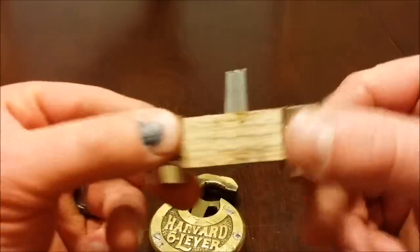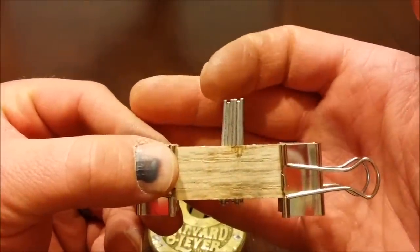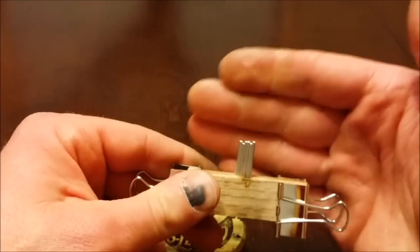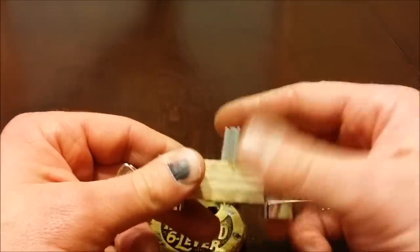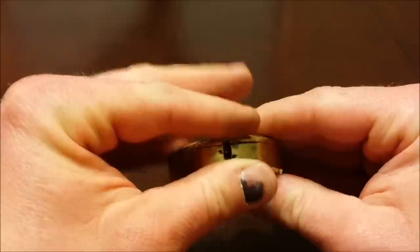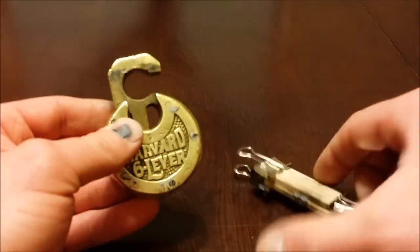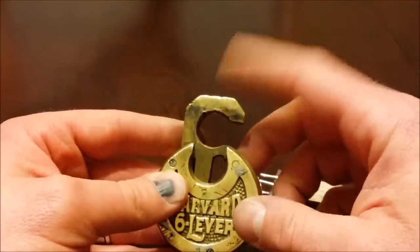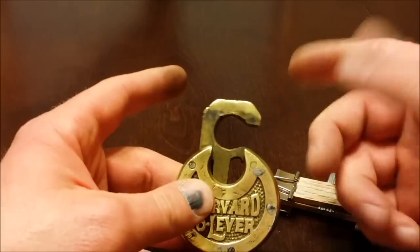Let's take a look at the key. I thought, oh no, because I don't think a key would be like two shorts and four longs — that looks way too easy of a key. Then my dad was looking at it and noticed all these little teeth are different heights. So basically what happened was all these levers lined up — they're stuck in the bolt that releases the shackle at the same height. They're all stuck in the right position until you lock it again.